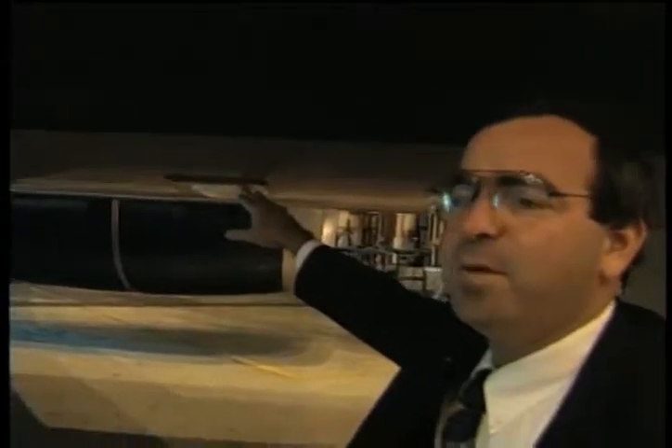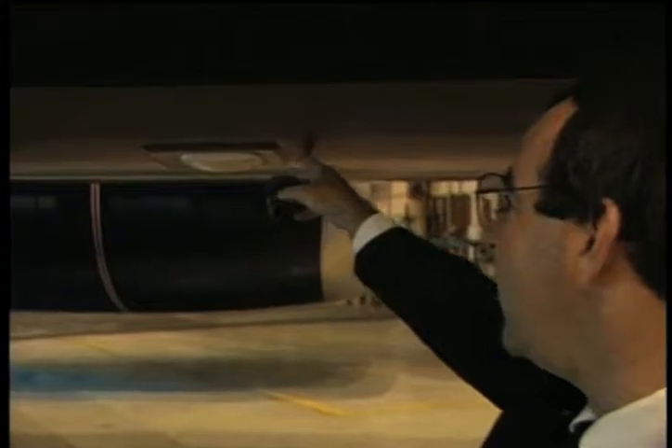This is the lower GPS antenna for receiving the pseudolite signals from the ground that's out in the approach path. Normally, an antenna for the air phone is installed in this location, and we put an adapter plate in here. The GPS antenna mounts to the adapter plate, which then mounts into the existing holes in the airplane. So for this antenna, there is no permanent change to the airplane at this location when we take the antenna back out and put the airplane back in service.